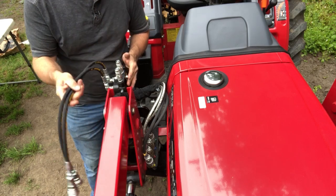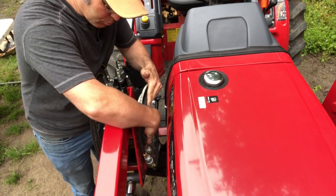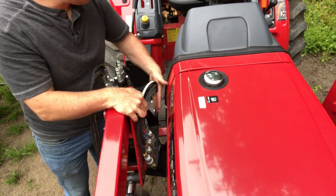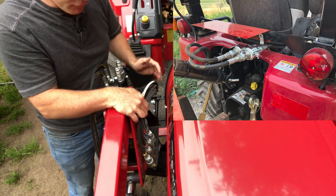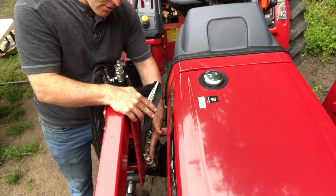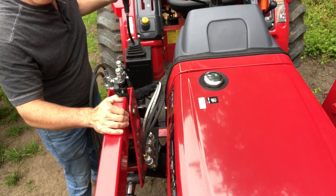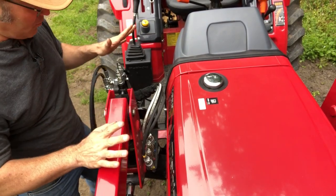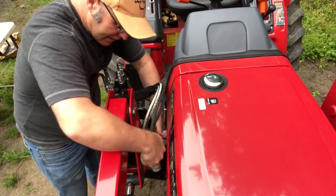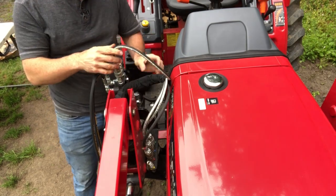With the switching valve mounted in place, we're now ready to connect the hydraulic quick couplers into the loader circuit. On this Mahindra 1626, we've got our colors labeled here. Blue and green here in the back are the lift circuit. So for this tractor, we're going to leave those alone. If you're running a remote to the back and want to run a hydraulic top link and have the float function, you might hook that into your lift circuit. Today, we're going to be plugging into the dump circuit, which is the yellow and red. So before we disconnect anything, take a second and move your loader lever control to all four positions. Make sure all the pressure is out of your system. With all the pressure out, now I can do these quick couplers one at a time. So I'm going to go ahead and disconnect the yellow, and yellow is in front, so I'm going to bring it up here to the front port of this switching valve. Nothing to it — that's easy.